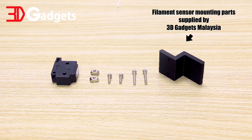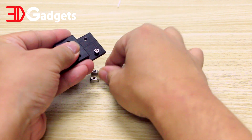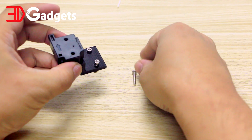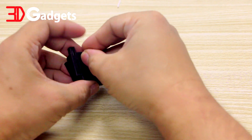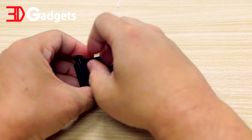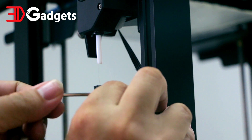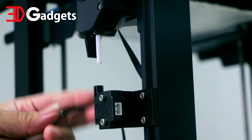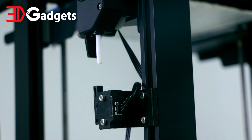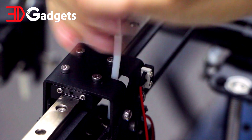For this section, we will install the filament runout sensor. All the components can be found in the bag labeled D3. Use the shorter screws with the T-nut and install them exactly as shown in this video. Mount the filament runout sensor on the holder with the longer screw — they thread in directly to the mount, no T-nuts are needed. Be careful not to over-tighten the longer screws as it might crush the plastic casing of the sensor. Install the whole assembly on the 2040 extrusion about 3cm away from the extruder. Install the included cable into the filament sensor. Insert the other end of the long PTFE tube into the hotend — make sure the PTFE tube is pushed all the way in, as filament might leak if the tube is not pushed all the way.